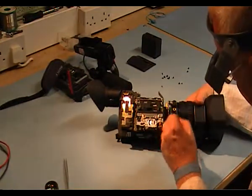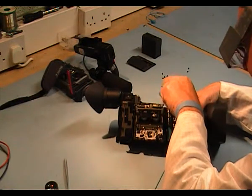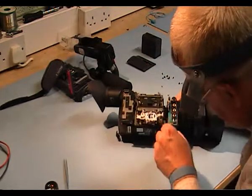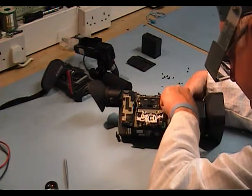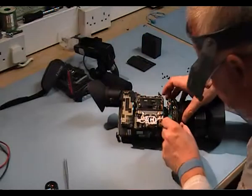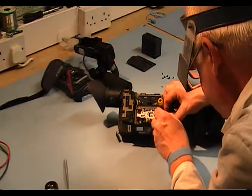This is the PCB that I suspect is damaged. To remove it, there's one screw up here — it's a long silver one. We'll have this one here, right beside the FireWire port. I'm going to remove it and just disconnect it down here. Carefully, we don't want to damage anything. Now lift like that and go down here and lift both sides.